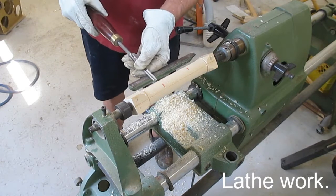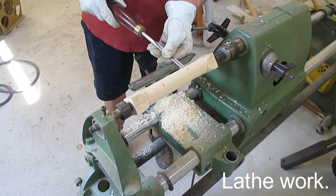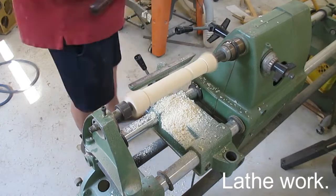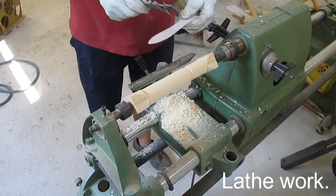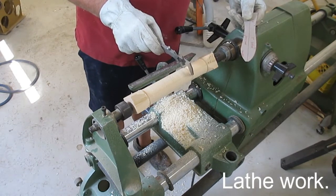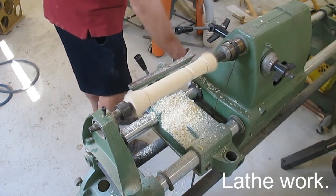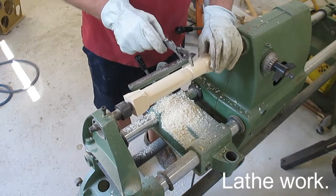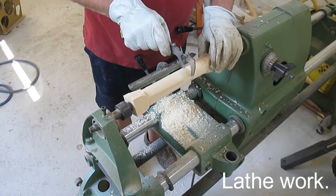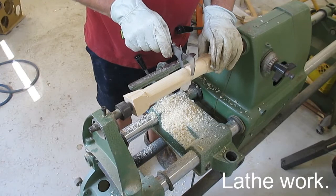I'll check how we're doing on the highest and then work on the curve in between. I take the measurement right off the template — it's for a seven inch, and I see I've got to go a little bit deeper. Remember I want to be a little bit high, a little bit bigger diameter than I need, and then as I get down to the final work I can take it down that last little bit. So I'm going to take off a tiny bit more.